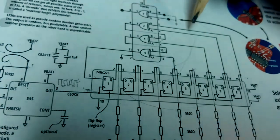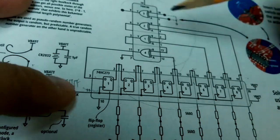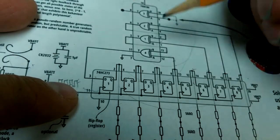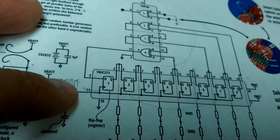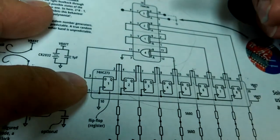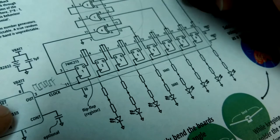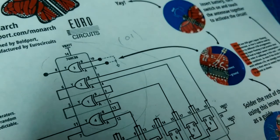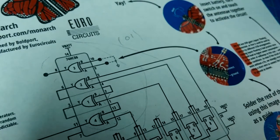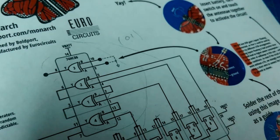And this thing's pretty cool. And there's a lot of interesting mathematics that goes into the theories behind it, because one of the things that you can do is you can create a mapping from all of the different taps and number of different XOR gates into what's known as a finite field polynomial space. So all of the possible polynomials are represented using a finite field, which, funnily enough, is 0 and 1. 0 and 1 turns out to be a finite field because it's closed under multiplication and addition, if you suitably define multiplication and addition modulo 2, then all of the properties of a field are satisfied.